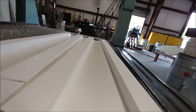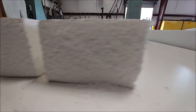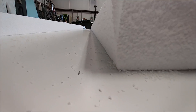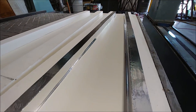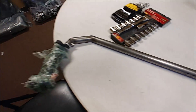Here's the other one, and if you look carefully at this angle you can see the negative draft — it's sort of leaning in. When you lay it up in there the part would generally get stuck. So we're doing the same thing here — putting the metal tape on there because the resin and stuff won't stick to that when you wax it up.